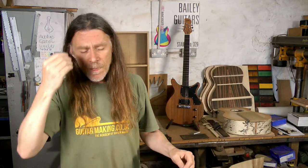Right, we've got some. So TV uses his Hoover. Yes, obviously keeping your sandpaper as clean as possible helps. But sometimes, especially with resinous wood, it gets really caked on and your Hoover just won't suck it off. So abrasive belt cleaner is the trick, says Rock and Roller 912. Someone asks, could you use a wire brush to clean sandpaper? The problem with a wire brush is that it's probably going to blunt your sandpaper as you're cleaning it. So yes, you can, I've done that as well, but you end up with a second-hand piece of paper instead of a brand new one. So it kind of works, but not as good as the magic rubber, the abrasive belt cleaner.